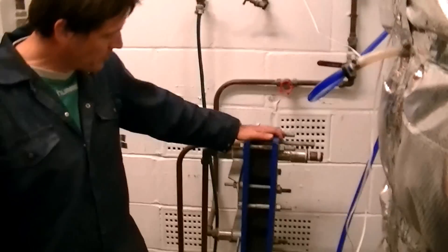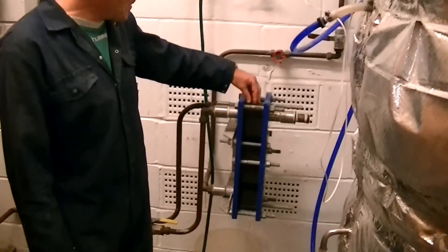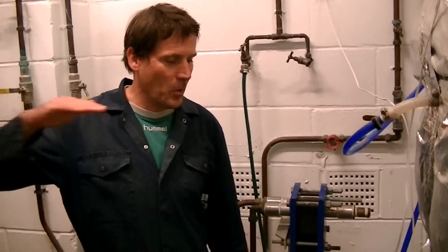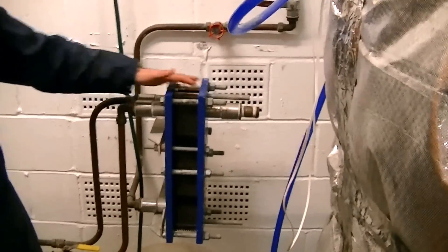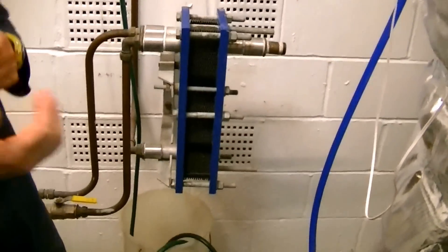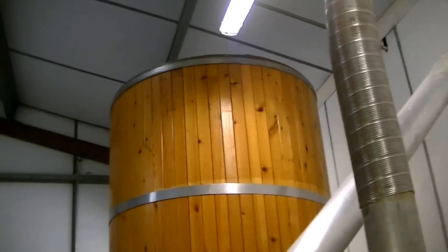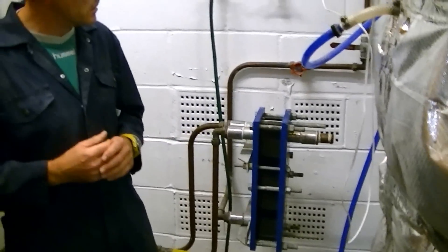What we've got here is a heat exchanger, which is a fancy word for a car radiator offensively. What we're using this for is a stage where we take our boiled wort, which has all the hops in, we then pump it through this heat exchanger radiator, and what that does is it allows us to extract all the energy that we put into the boiling of the beer back into the water that we're going to be using either for another brew, which goes into our hot water tank at the top there, or we use it for cleaning.